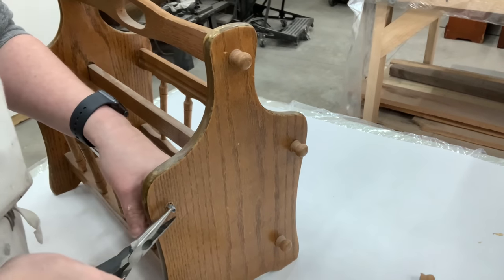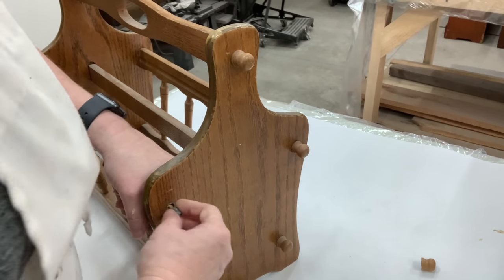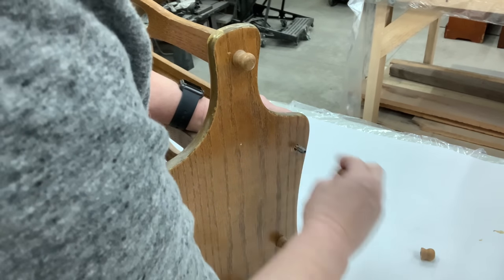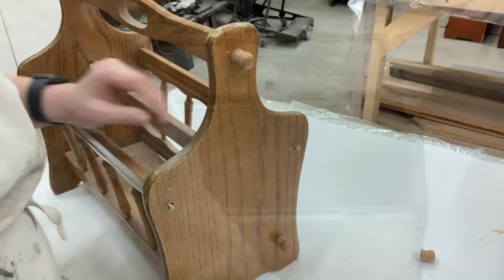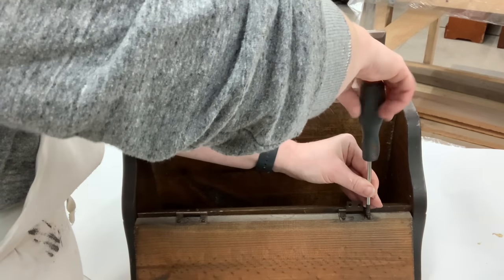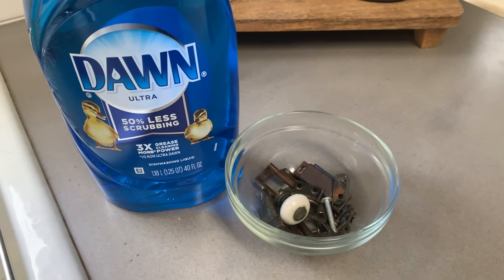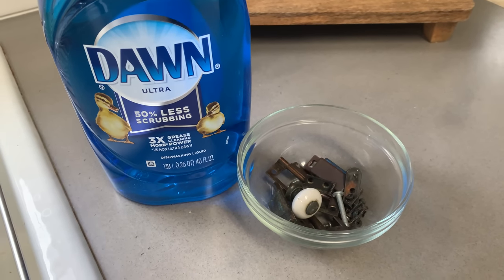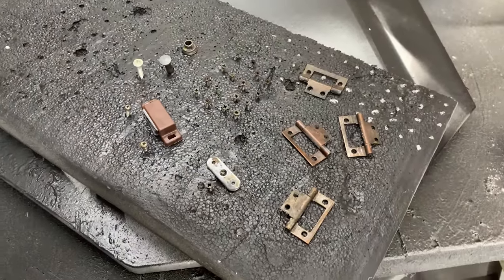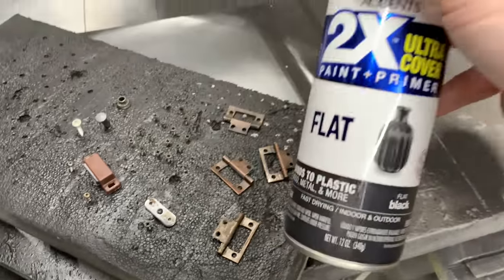This little magazine rack was missing one of the little knobbies that give all that detail. So I'm taking them off and trying to figure out what I can do, because that actually holds it all together. And then for this little storage desk, I'm going to be removing any of its hardware — all these hinges and that little knob. My go-to for cleaning hardware is Dawn soap — it is just a great cleaner. These were all thrifted items, so you don't know where these pieces have been. After they are dry, I put them on a piece of styrofoam so I can stick those little screws right in where they need to be — no losing screws.